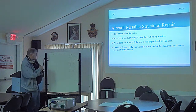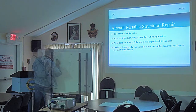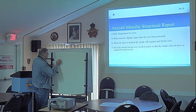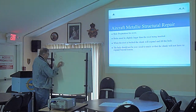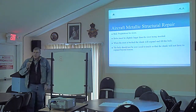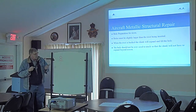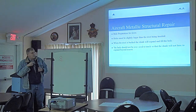The stress risers need to be removed. If we've got a hole — looking straight down on top of the hole, and then turning it to the side — here's our hole here. Now what we end up with is that if you put that underneath the microscope, there's a whole bunch of jagged edges. To us it looks smooth, but if you put it under a microscope it's really jagged. So we need to get that smooth.